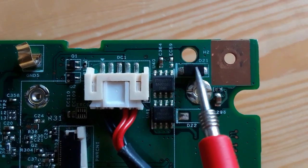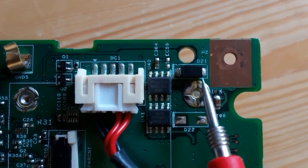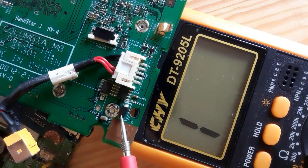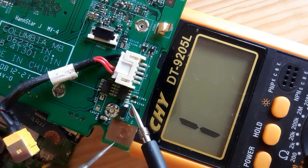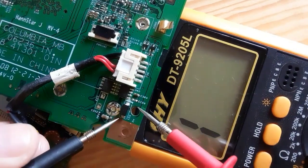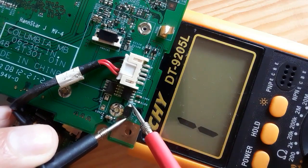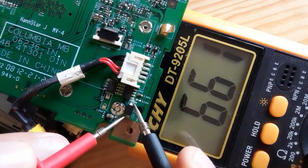For the double diode you will get two readings. We also have another type of diode — a bigger one. This is a protection diode, found near the power jack. This white line means cathode. To check this diode using the multimeter, the same working principle applies: red probe to positive terminal, black probe to negative terminal. We should get a reading of about 600. If we switch the probes, we will not get anything — means the diode is good. If the diode is bad, you will get a continuity beep.